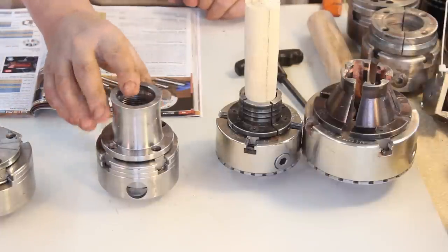This is another set that's very similar - these are also long nose jaws. There's a lot to think about and consider, and when you're a new turner it's really difficult. Ask a friend, go to a club meeting, and figure out what you need. I may have some duplication with similar jaw sets, but there are times when I'm chasing threads using one chuck on one lathe and making a corresponding insert on another, needing a very similar set of jaws. It's a luxury, I'll admit, but it's very nice. Don't start out with all this - go very slowly and carefully, and if you have any questions, contact me. I'm the Wyoming Woodturner. Thank you very much for watching.